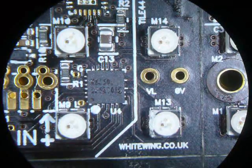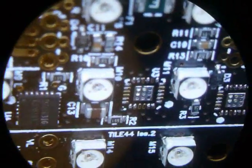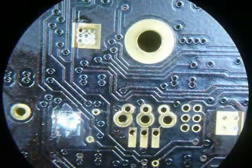Let's have a look at the sides. As long as you've made the pads long enough to extend outside the device, you can actually see you've got a decent bead of solder there. And that's it. After you've finished, just braid off all the excess solder on the bottom.